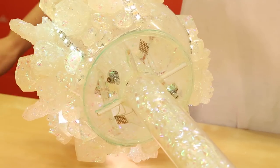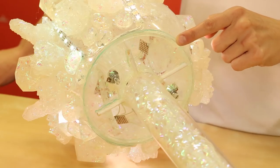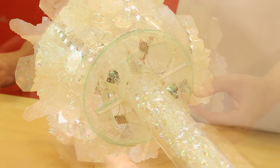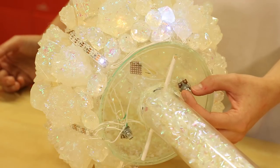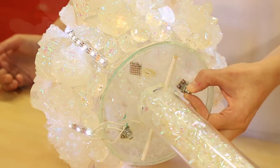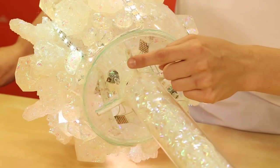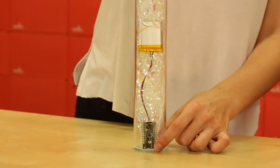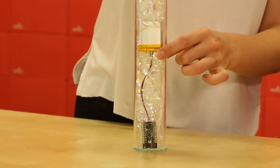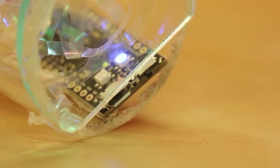In order to get the fishbowl to sit on top of the staff securely, I laser cut a piece of clear acrylic. This is where you'll find the two potentiometers to control both the speed of the animations and the animation that you choose to use at that time. This is held in place by two wooden dowels that secure the acrylic plate onto the staff. The Q-Duino and the battery sit at the bottom of the staff for easy access to power, recharging, and reprogramming.